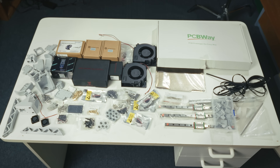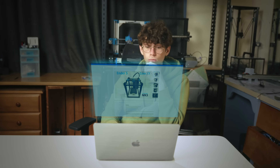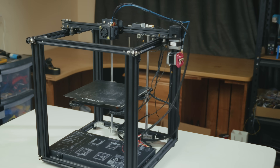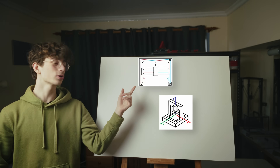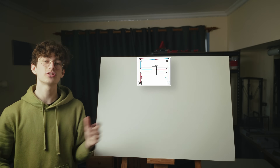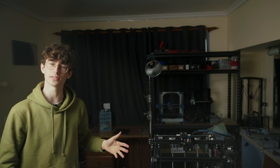Here's all the components for the build, but for now we only need these. While browsing Thingiverse, I found this Core X-Y conversion by Boothy Builds which will be the heart of the build. But why is it such a big deal? Core X-Y has many advantages over a Cartesian motion system, which is what the Ender 5 uses despite its appearances.